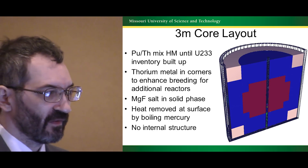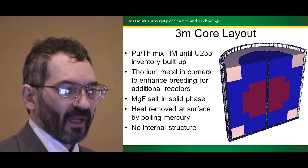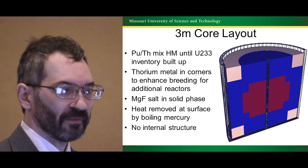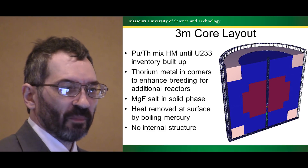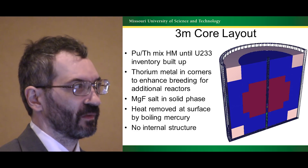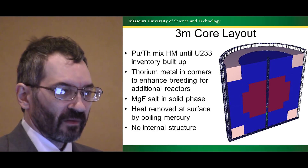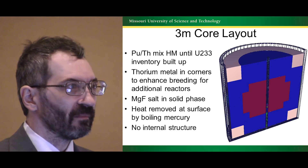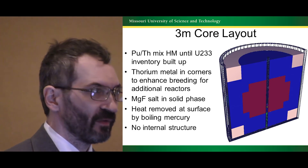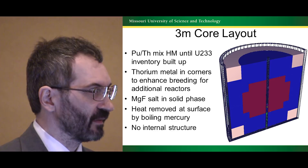The core that I designed for this is using a solid-state fluoride salt. If there is melting, it would be in the center red portion where the system is fueled at startup. The blue portion is just thorium salt — that's to breed up. As the kernel burns down, the blue portion breeds up and it maintains a steady K-effective through the run. The thorium metal I put in the corners to weight down the core. The density of mercury means it will float most anything — you can float a steel knife on a mercury pool without a problem.